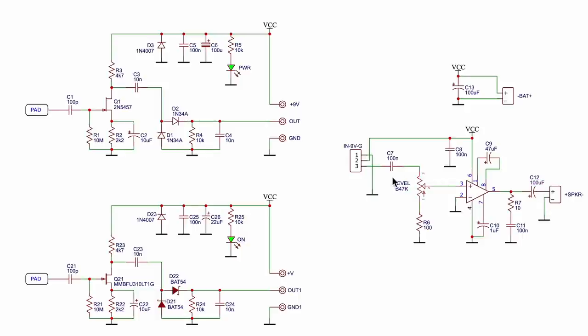The signal is coupled through a capacitor for DC blocking, which we could have in a standalone signal tracer — you could be tracing parts of a circuit with DC present. This is a single supply using a 9 volt battery with a filter capacitor. The output will probably be at around half that voltage, so you need this output coupling capacitor to connect it to the speaker.